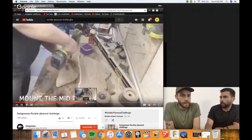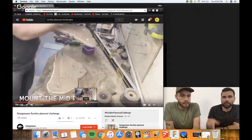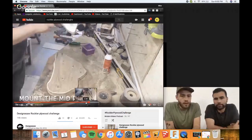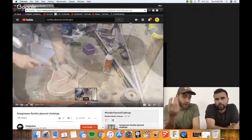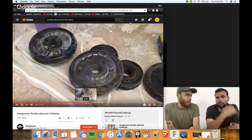I find it just takes up too much more cutting time, and I just want the flexibility, and it's not that long just to put screws and glue into it. And as long as you're screwing somewhere into the center of the piece that you're adding on, even if it does split a tiny bit, you're only exposing the edges.